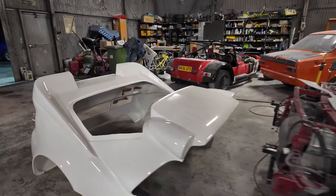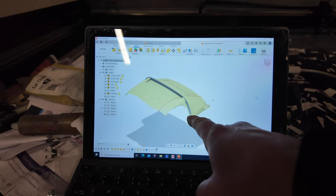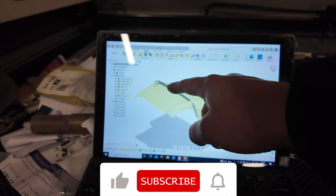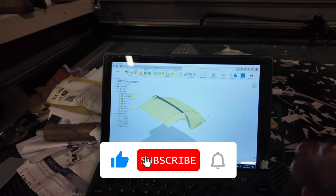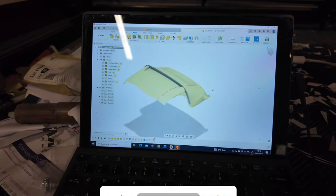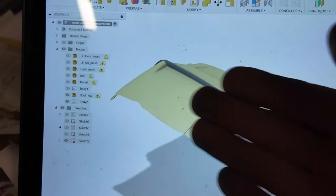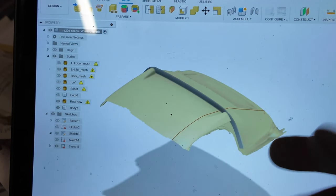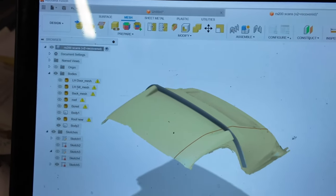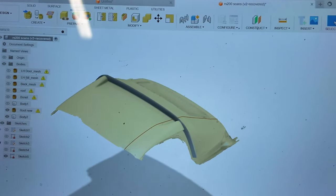I'll just show you what Jonathan's been doing. What he's got here is a scan of the roof and then he's worked out the profiles of the roof so that he can cut on the laser cutter the fence to go across the roof, because he's going to mould the roof in two sections - in fact three sections, because there are the undercut bits as well. That gives us the bit to create the upface to bolt it together.